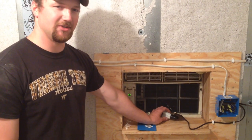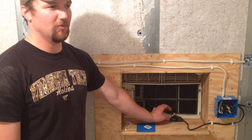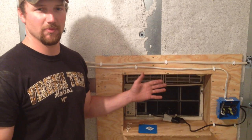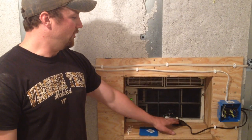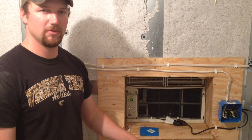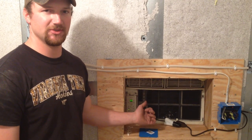This nightlight is attached to the thermocouple in order to trick the AC unit into thinking the room is warmer than it actually is. So when we control power to this, we can drive the temperature down below the AC unit's setting.